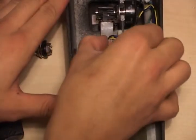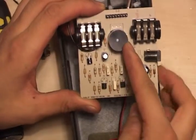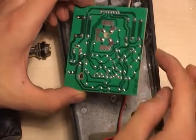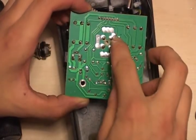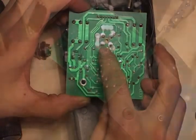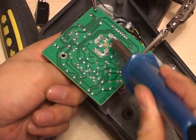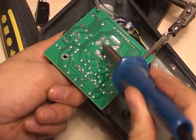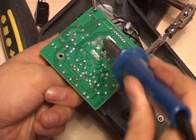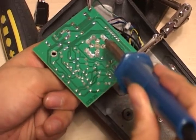Remove the wire and connector plug. You can see here that this is the stock inductor we're taking out, and if you notice on the back, these four points are where the feet are soldered in. The best way to remove the stock inductor is to go around with the soldering iron, melting each of the four points and pulling just a little bit on the inductor from underneath until you edge it out completely.